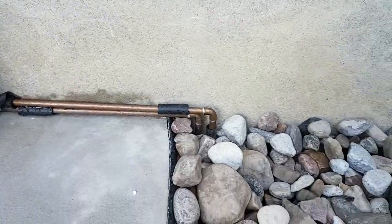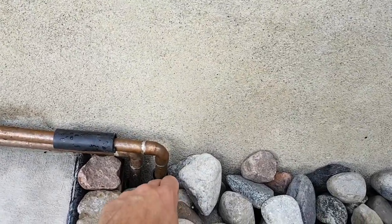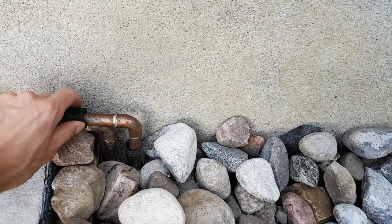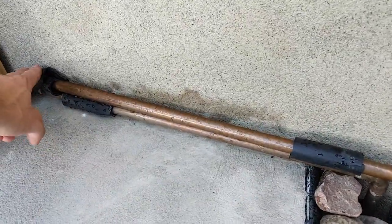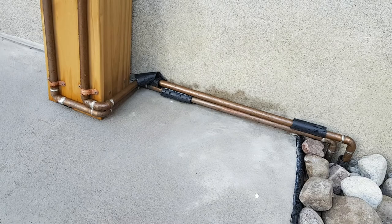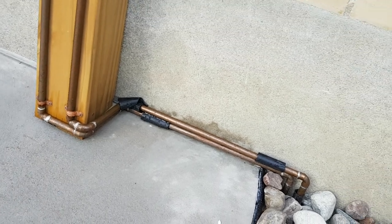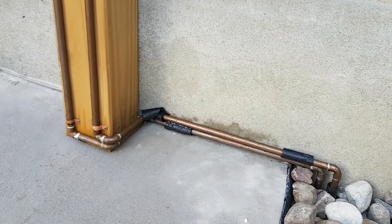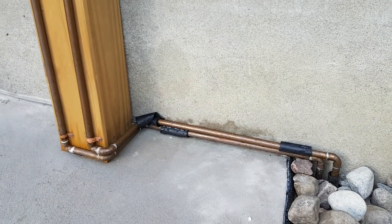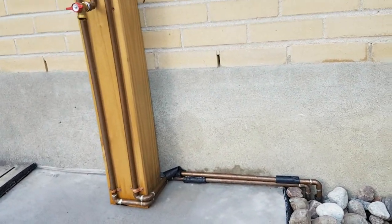The water lines passing through the little rock garden area here are sleeved inside of irrigation line — similar to PEX material, very flexible. I've cut some pieces where the copper pipes come close together because I don't want them touching or rubbing. I probably could have run them under the concrete, but this is outside and we do get winter here. I want access to all the plumbing — I don't want anything buried or nestled inside a concrete encasement. That's why I opted to do it this way.